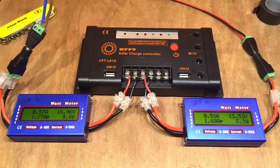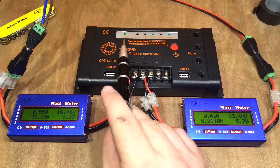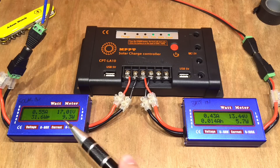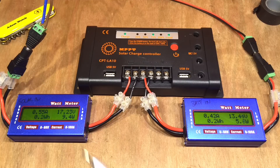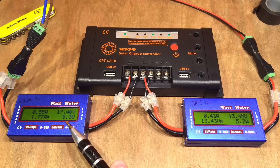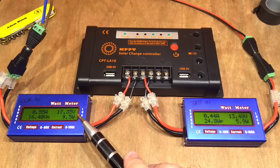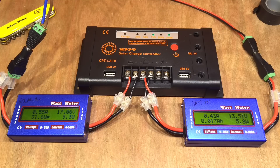We've seen it get up to 20 watts for a short period, with 1.77 amps on the input maximum and 1.68 amps maximum going into the battery. The charge controller is flashing to indicate it's charging. So it looks like you can buy an MPPT solar charge controller for less than £50 — I'm having to eat my words, because this is clearly doing MPPT. Not necessarily terribly efficiently — 9.5 watts on the input and 5.7 watts going into the battery at one point — but it is definitely doing DC-to-DC conversion and seems to be tracking close to the maximum power point of my panel. Now I'd like to test even higher voltages on the input.